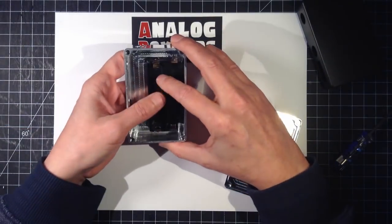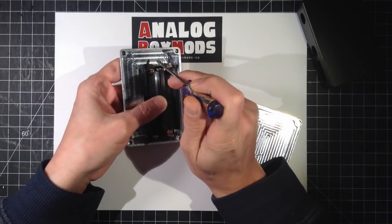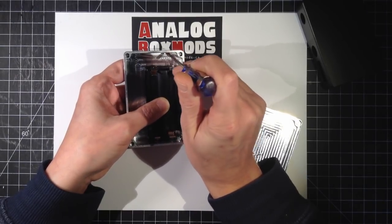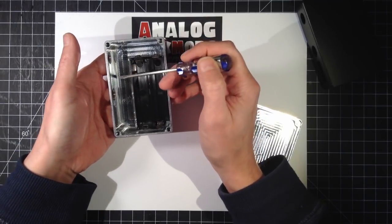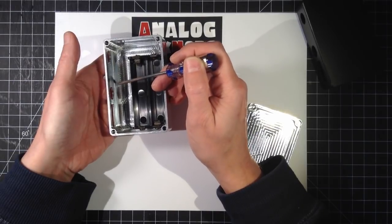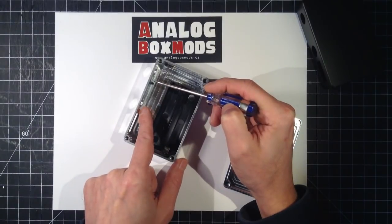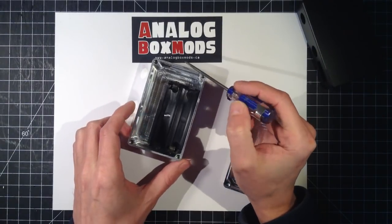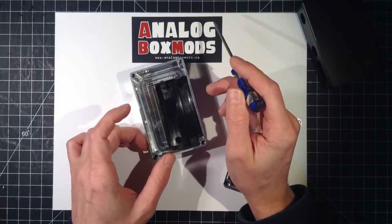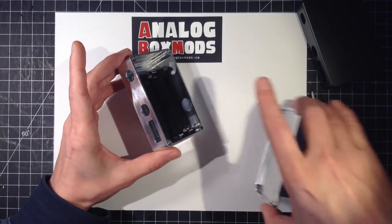And so the dimensions, what I tried to do here, there's enough room at the top. If you fit the Big Al's IPWM, the sled mount board, which mounts on the top of the sled here, plenty of room here, and long enough that you can also use the Big Al LiPo board, which has the pot, so it's connected to the pot, and it fits nicely between there and the fire button. So minimizing the wasted space and still a little bit of slack to not make for an impossible build. So the third one then is this PWM enclosure.